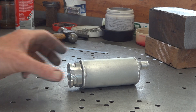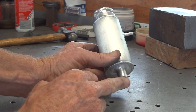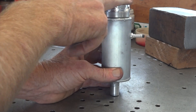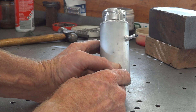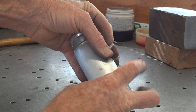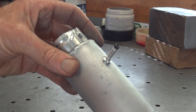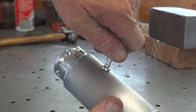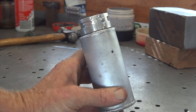One of the final items is just a little header tank whose job is to hold some air to put some spring rate in the system. Water goes in there and fills up, for the top water pipe through that hole, and obviously the radiator cap controls the pressure. This little thing is an air bleed off the top of the engine so that it fills up with water and not a mixture. Just a little tweak here — trying to weld that little five or six millimetre piece of aluminium would be impossible, certainly for me. So two little cheats: it's machined with a weld flange at the bottom so you can put some heat into it, and to hold it in place while I weld it, a little M3 bolt into a tapped hole. When it's welded on, just run a three mil drill through to clear the thread away and no one will ever know.